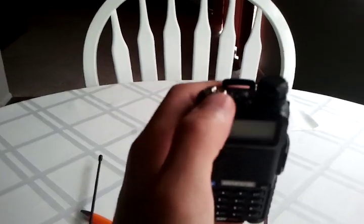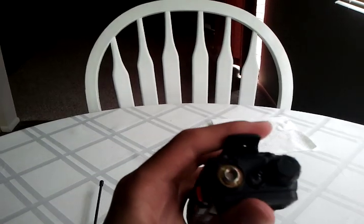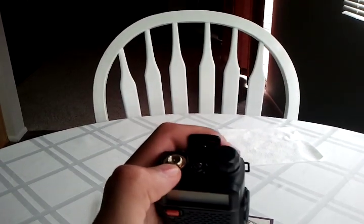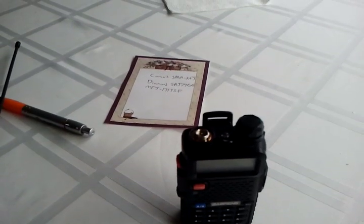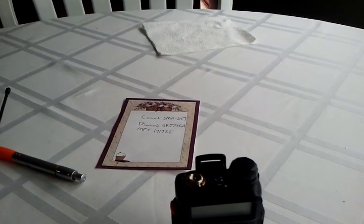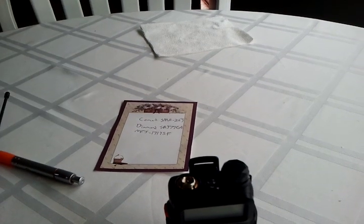As far as connecting external antennas — like fox hunting antennas or something you want to put up higher — it's really not that big a deal having a different connector. They make a lot of adapters that will have an SMA female going to a UHF female with maybe a 19-inch coaxial cable so it doesn't put too much stress on the radio. There are also solid connectors about an inch or two long that would go SMA to UHF.